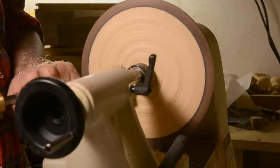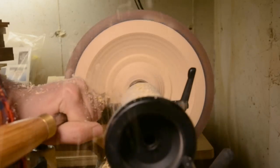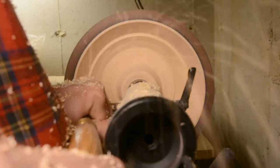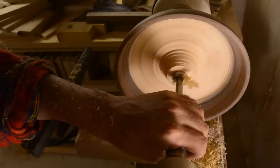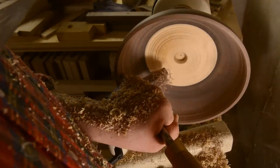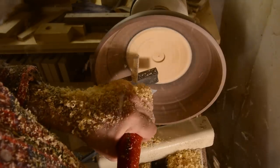After two more pours — seven total — I had a waste block added on the bottom and trued that up so I could turn around and start working on the inside. On the outside I had used the Easy Wood Tools finisher and got some tear-out in the epoxy — not too bad. I also got some on the inside with the bowl gouge; I'm going to assume that's just due to my skill level. I didn't want to wear the gloves this time, so I ended up putting some tape on my finger and the side of my hand, and that helped a lot. I figured if the tape got caught it would just rip.